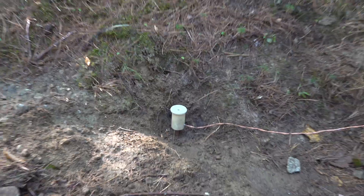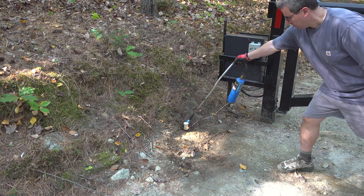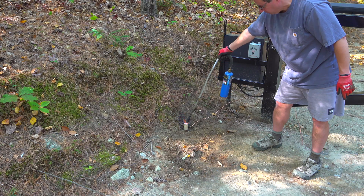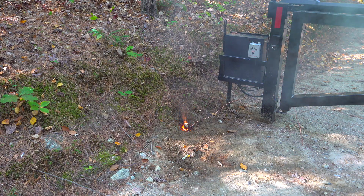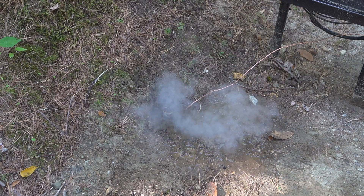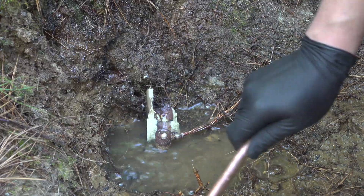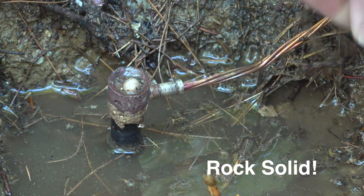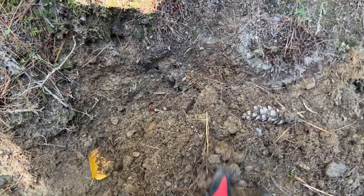This took a number of attempts. I've only used one of these CADWELD kits years ago, and back then I had an electric igniter. They came out with this kit specifically for a homeowner so you can do it without buying any special tools. Eventually the heat got inside the crucible. I did panic a bit when it lit because I wasn't sure if it was going to explode — I couldn't really remember how intense the flame was. After waiting just a minute or two, I poured some water on it to cool it down, and then you literally break the crucible apart. What you're left with is a completely welded connection. Next I'll cover up this grounding rod and bury that wire completely until I can run it up into the box on the gate itself. At this point, my grounding rod is complete.